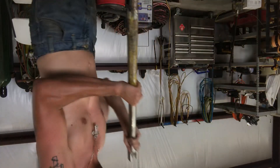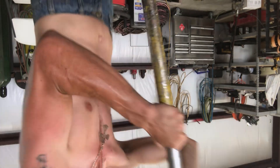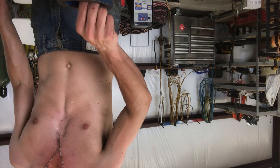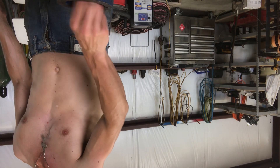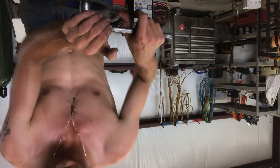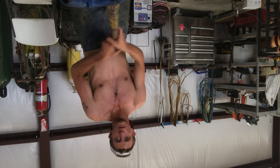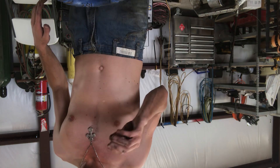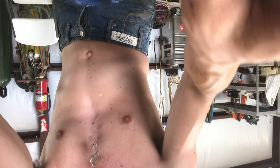It takes a little time — get her set all the way in there, your threads will be gone. There she is. Turn her back over, take the other half-inch bolt, drop her down on the bottom of the plug, throw it down in there, just give her a snug. Take her valve bar and give her a test run — she's good to go. Guaranteed open, guaranteed it's got plenty of grease. This valve is going to do well for a while. That's the right way to do it boys.